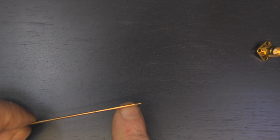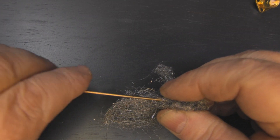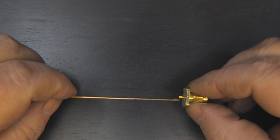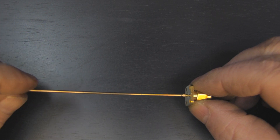That's all the grinding out of the way. Now I'm going to shorten it a little bit because it's too long, and also clean up the tarnish with some wire wool so we can get some solder to stick on the end. I've shortened that little peg so it fits in there a lot better and cleaned it up with some wire wool. You can see it will sit in that solder cup now even without any solder — that's what you're looking for.